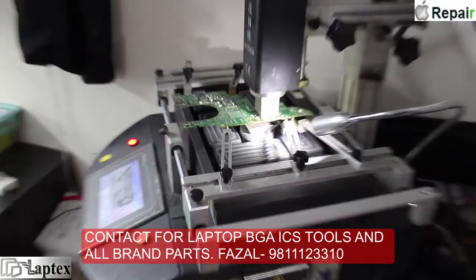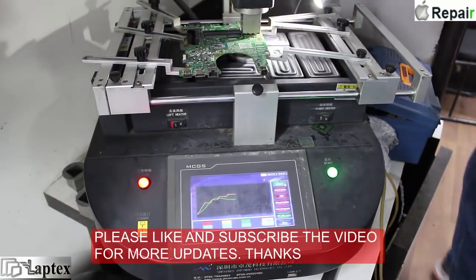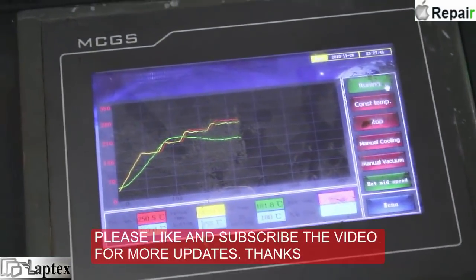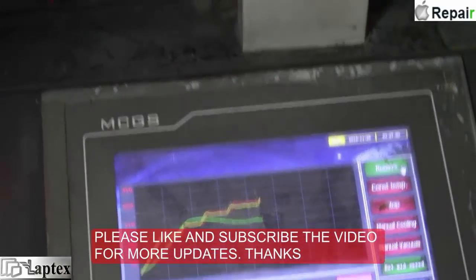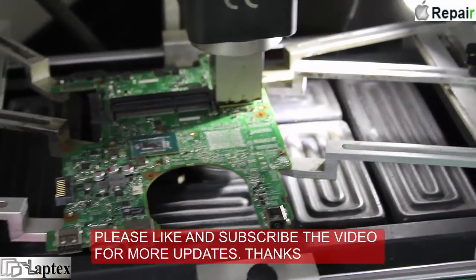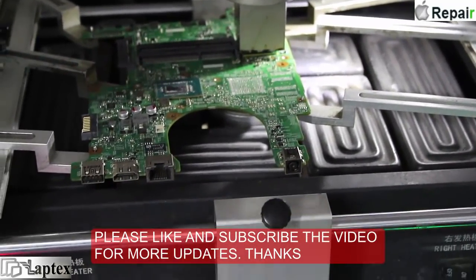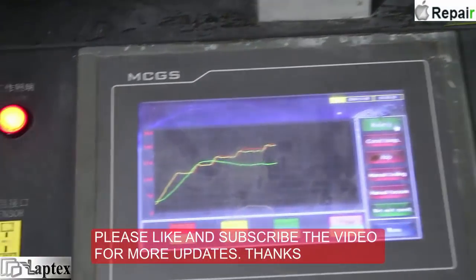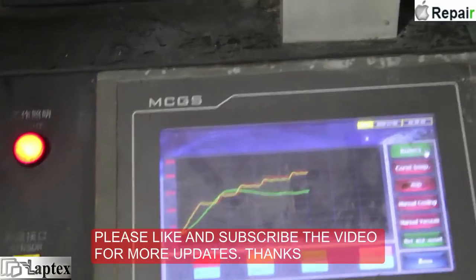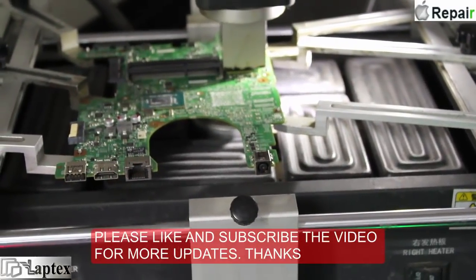We daily replace at least two or three ICs with the same BGA machine. We have started the BGA machine and the process is going on — you can see the temperature has reached 240 degrees Celsius. I have made different temperature slots. Even if you make only one temperature setting, you need to know what temperature is required for the specific IC or specific balls. The new IC comes with lead-free balls, so it requires at least 280 degrees Celsius, and my BGA machine is increasing heat and about to reach 280 degrees Celsius.